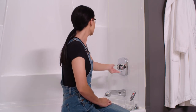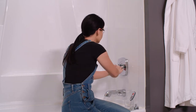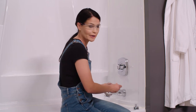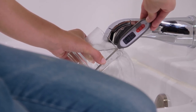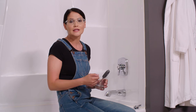Now I'm going to jump out and test the water again. I'm going to turn the water all the way on, and I want to make sure that my temperature knob is all the way hot — not turned cold. I'll let this run to get it as hot as it can get, then take my thermometer to see where we're at. Mine was holding steady right at 106–107 degrees, which is exactly where I want it — right between 90 and 110. Make sure you get a steady temperature so you don't get a false reading, and don't pull the thermometer out too early while the temperature is still climbing. If you need to adjust a little more, just repeat the same steps — adjust little by little until you get the right temperature.